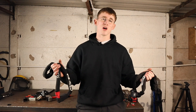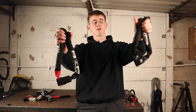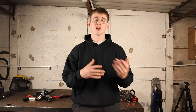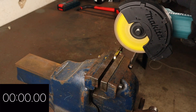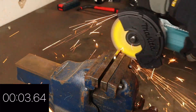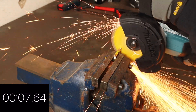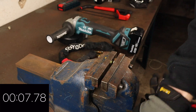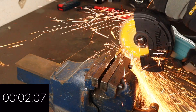I'm James from Bike Lock Wiki and this is part two of destruction testing between the CT Lock Viking Silver and the Abus 8900. During part two we'll continue destruction testing either of these chains, although we'll be using some more extreme tools to target and attack either lock. First we'll start with angle grinder testing using a 125 millimeter 18 volt angle grinder, which is more similar to what thieves will be using on the street rather than a mains powered grinder that many other security review channels use.